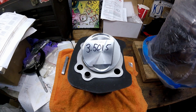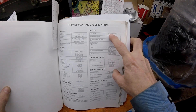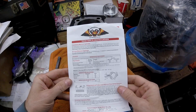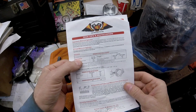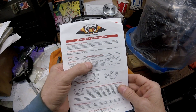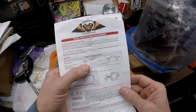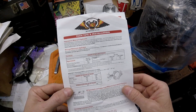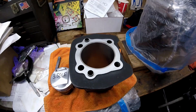The Harley manual says the piston-to-cylinder fitment should be 7.5 ten-thousandths up to 1.75 thousandths of an inch. With these Keith Black pistons, if you're running hyper-eutectic pistons under four inches with an aluminum cylinder and steel sleeve, it should be 1.5 thousandths minimum piston-to-wall clearance. John normally sets them up a half-thousandths over what they recommend, and I've always been successful with his recommendations.